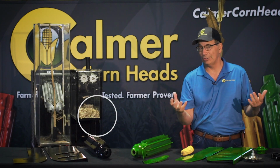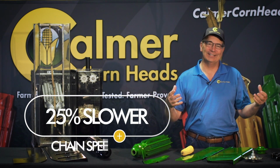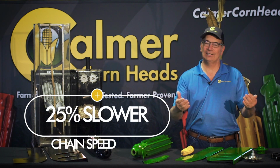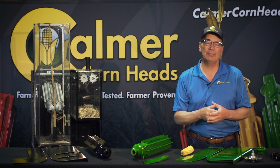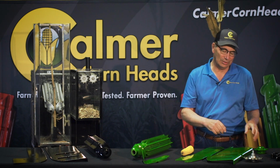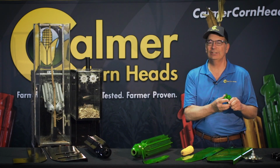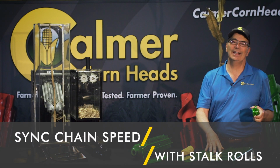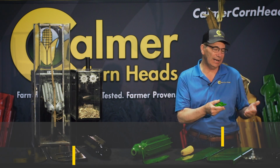And many of us have harvested on a dry day, and we've seen that large pile of fluff in front of the auger, and we just can't get it to flow on through. That's what's causing it: the gathering chain just breaking the top of the stalk off before the stalk roll has a chance to pull it down and put it on the ground. So from the factory, they use an 8-tooth. We're going to use a 6-tooth at the top of this row unit, to slow that gathering chain down just a little bit and give the stalk rolls a chance to make the stalk disappear. Now, we're still using the standard OEM chain.